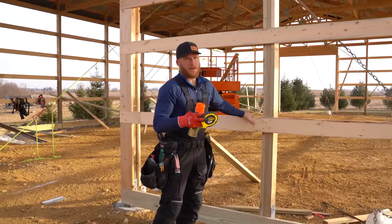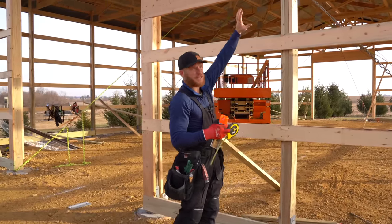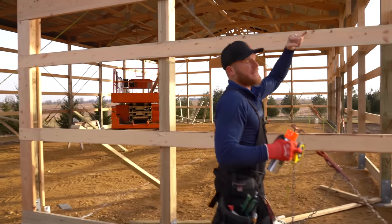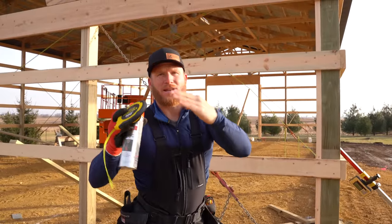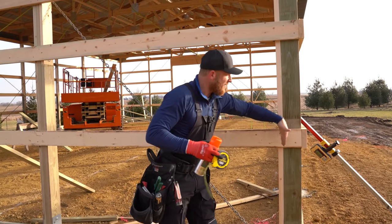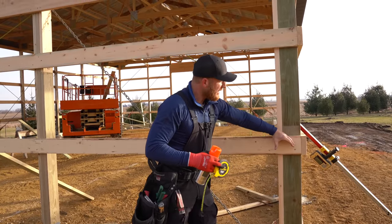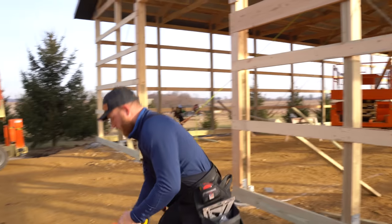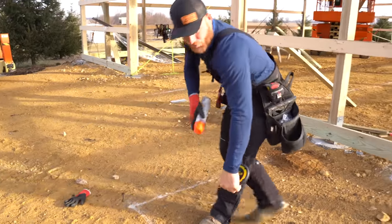Two things. I wanted my porch edge, my fascia, where my gutter is at and all that water flashing detail coming off the roof, I didn't want it to die on a rib. And another thing I didn't want is my peak of the porch, this gable, dying directly on the corner. So I wanted it offset on the inside of the building. That way we can have a nice spot for our ridge cap to die in. And you'll see that here in the future, but what it means is that our porch spacing on the front is not 8 foot, but I don't think anybody's gonna even notice.